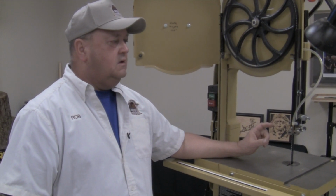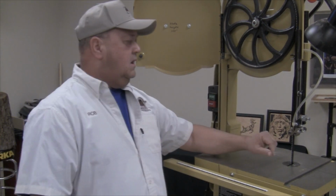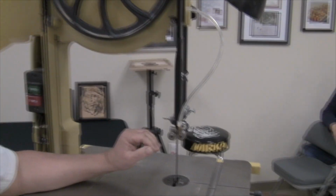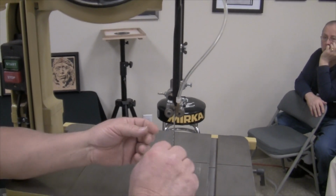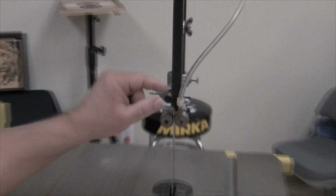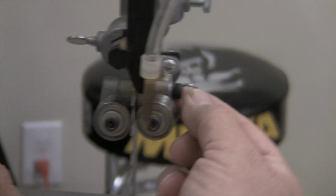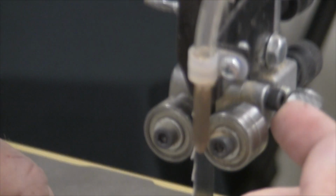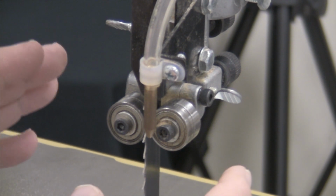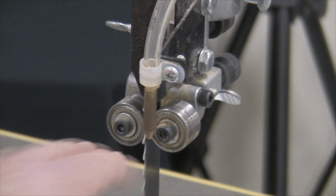If you're going to put those on, just make sure that you've got a good surface, and you're holding it apart there. And then on the rollers here, on this one, the adjustment's different on every one. My Jet, you open up a thing and you can just roll it by hand. There's a little thumb screw here. This one, you have to loosen it up with this Allen wrench here. And after it's loose, that loosens up both the rollers so that you can move it, but you have to put an Allen wrench on each end to swing it.